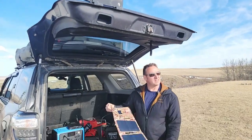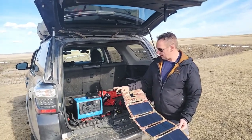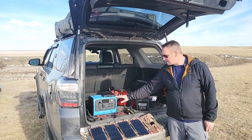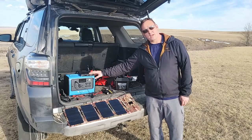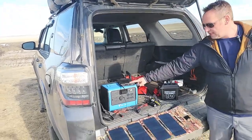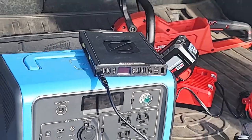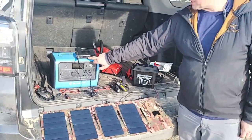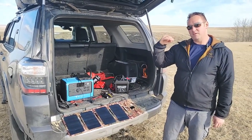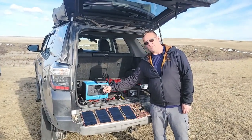It's almost 5 PM and it's pretty late in the day — nine watts. So this gives an example of how you can actually charge one of the more well-known battery packs like this. Same thing with the Goal Zero — they've got the smaller ones like the Yeti 400s, and they've got the 100 AC here. If I wanted to power it, you can just plug it right in here. I did testing two days ago and compared charging from our USB Type-C port to the USB Type-C on the Sherpa 100 AC. Because USB Type-C actually requires a minimum wattage, if you get a little bit of cloud cover, it's way better to use the DC5521 port — it's less finicky.